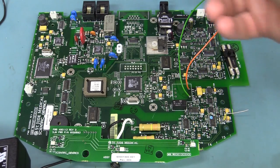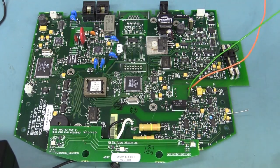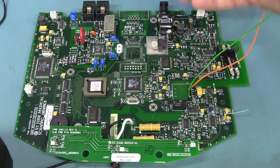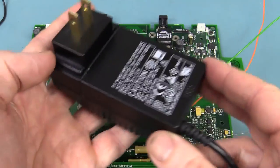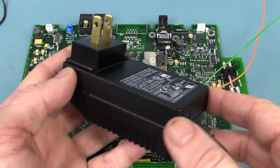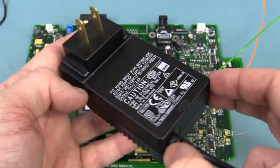Basically it's going to have increased clearance and much better build quality than your one hung low one from China. So everyone wanted to take a look at it, so let's go. These medical devices, as I explained in the previous teardown, everything is medical grade isolation in here — from the clearance on the ground planes to the type approval used on the transformer, the high value resistors, all that sort of jazz, and the medical grade opto coupler for transferring the data. You should see a big difference in build and both clearance and creepage distances — yes, they are different things — as I'll explain when we open it up.